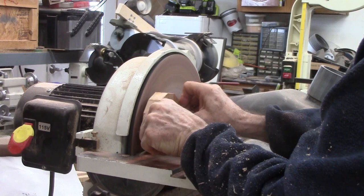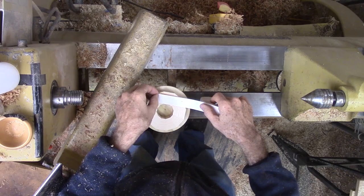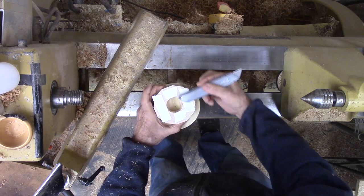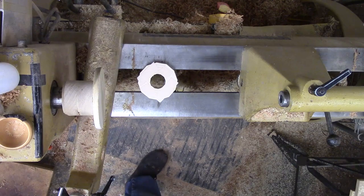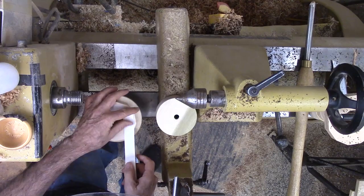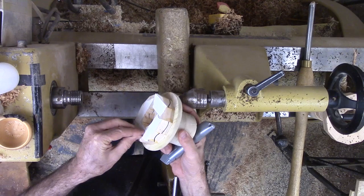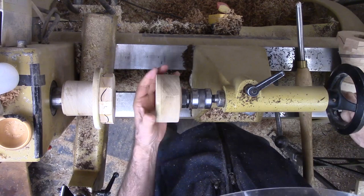The next task is to flatten one side of each ring on the disc sander. This will give me a good glue surface. I start with a maple ring that will serve as the first and last layer of the bracelet. Double stick tape will fasten this ring to a waste ring. The waste ring is glued to a threaded wood faceplate. I cannot live without these - I have dozens of them in a variety of sizes. The waste block has been faced off and flattened previously. Using a Longworth chuck on the live center centers this ring and presses it against the waste block. I know that I want maple on the opposite side of the bracelet, so I add more double stick tape to another faceplate on the opposite side. Since the ring is already centered, the second faceplate is mounted to a threaded live center that accepts my waste block.